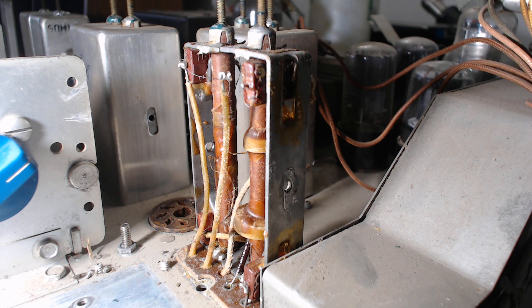What I did was use a hot air station — you might be able to use a hair dryer. You heat up the two sides of the IF can, then twist it back and forth gently in a 360 motion — not pushing left or right, but rotating catty-corner. You'll hear a crack, then slowly work the top off. Try to keep it mildly warm so the wax stays almost solidified and you can get the top off.